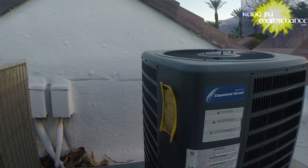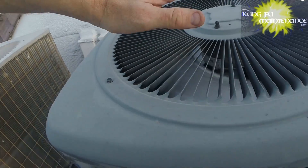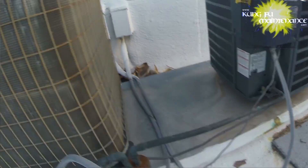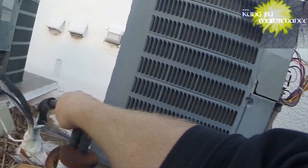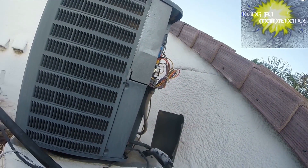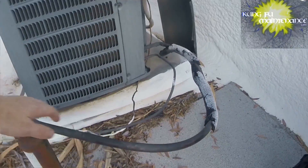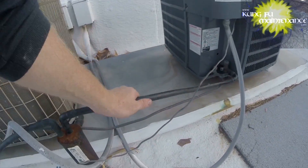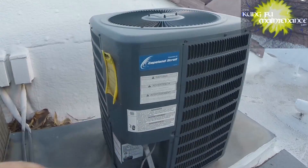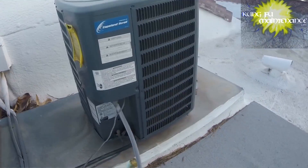You hear the sound of the compressor trying to start. We're going to have to pull it and check it. It's getting warmer. We're just a little low on Freon. Let me go see if this other unit started — I may need to go get my Freon anyway, and I'll need to get another capacitor. Oh, it started! Nice and cold. I'm still going to check that capacitor. It did start though.